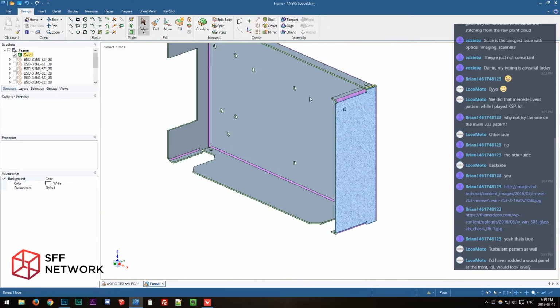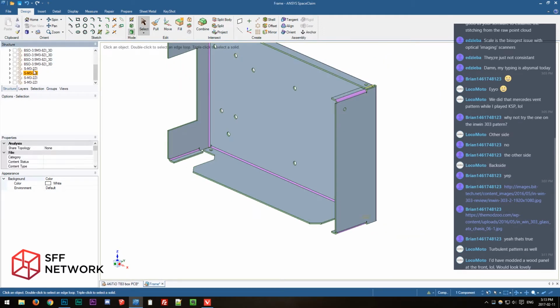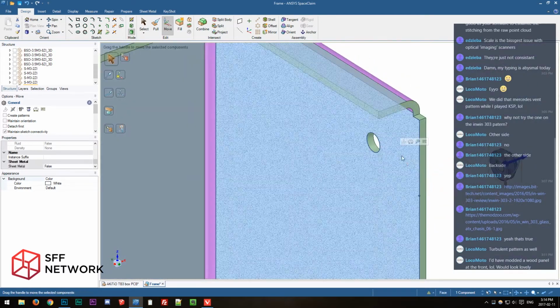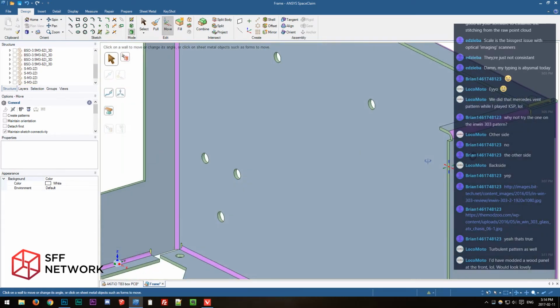And then let me see, where else are there PEM nuts? Oh, there's one. There are others in the frame, and that should be the right size. So yeah, we'll just copy this. But if you're ever doing case design and you want to use PEM nuts, the dimensions you need for the hole to mount it in are all going to be on the spec sheet.